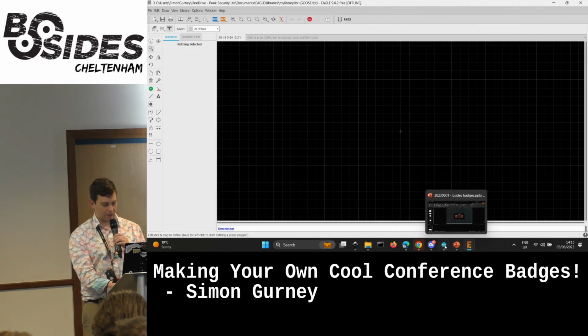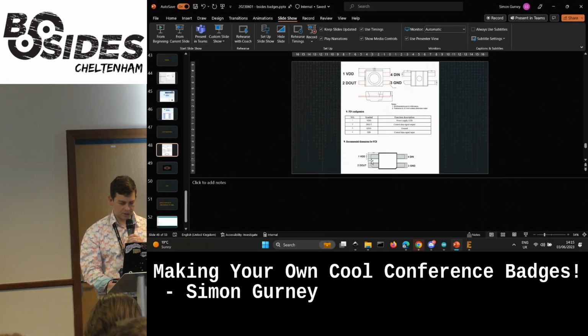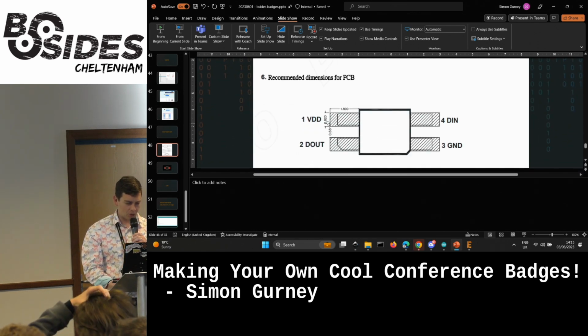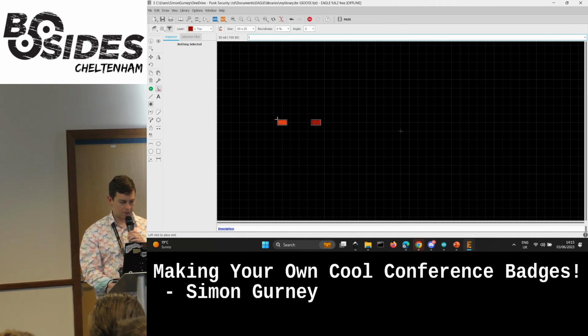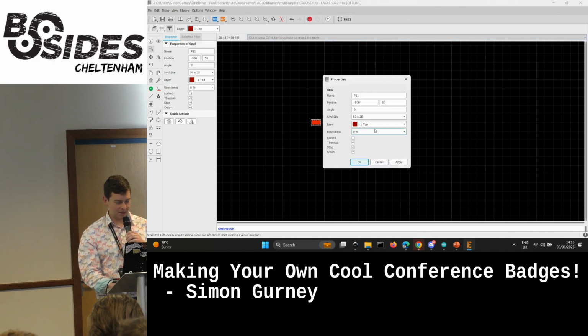Okay, so if we go back to that schematic, they wanted us to do a footprint. Let's go down a bit. There you go. Footprint should be 0.82 by 1.8. So we create a pad. Oh, I messed that up straight away. It's so forgiving. Let's just chuck it in the bin. Right, here we go. SMD size.